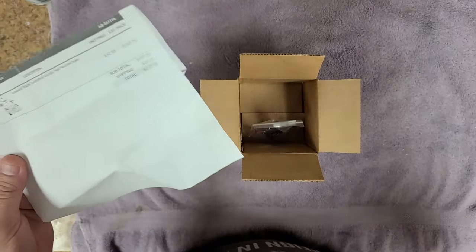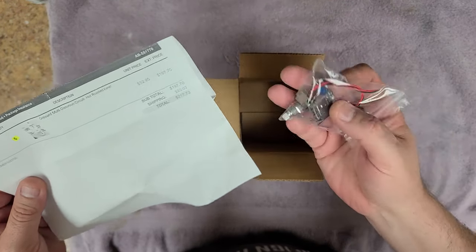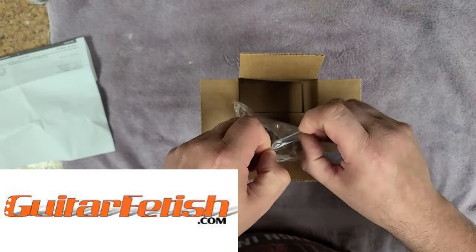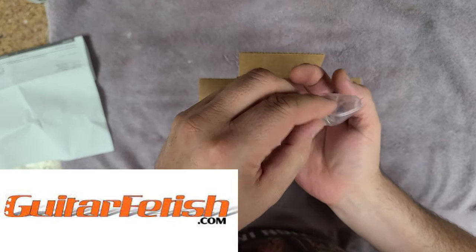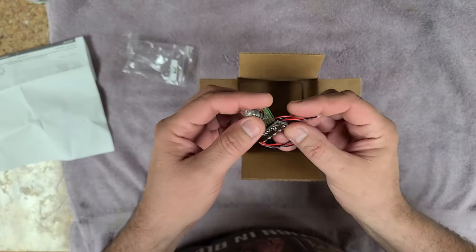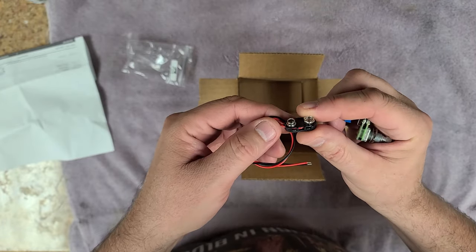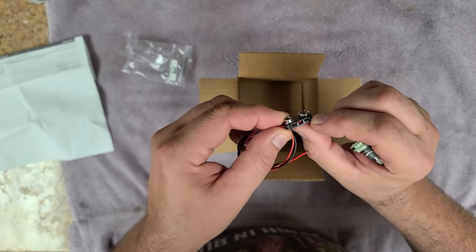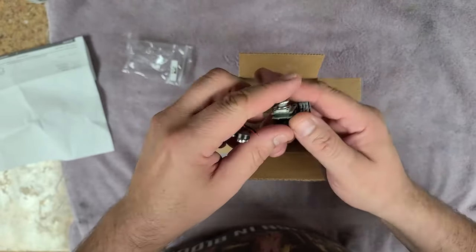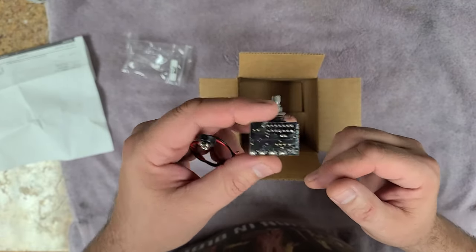The total for just one does not make too much sense as far as what I paid. These are $32 a piece and I ordered six of them, so I'm going to have to send these guys an email. What this is — it's an onboard multi-distortion circuit called Hot Rod Tone. It's a tone replacement: you replace your existing tone control on your guitar and put this in its place. You'll have to hardwire it. It comes with the wire for the battery — kind of a cheap one for a 9-volt. I don't like these; they usually fall apart and break.